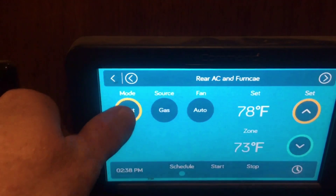Rear air conditioning is zone two, front air conditioning is zone one. The way the in-command system and the Dometic talk to each other is through a gateway - depending on your manufacturer of course. This big plastic Dometic boxy thing is the gateway. What it does is the system daisy chains your air conditioners - we go from your in-command control up to your front air conditioner, and then it daisy chains through and comes back here. This rear plug coming into the gateway, and then that second plug on the right -